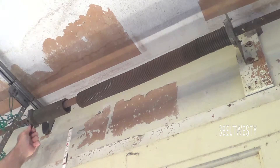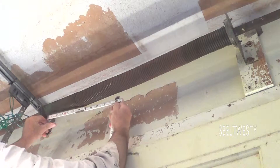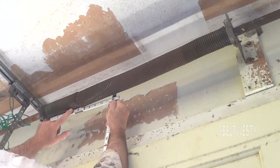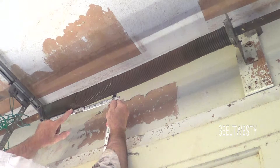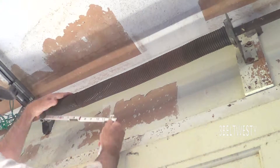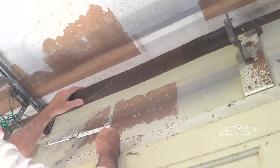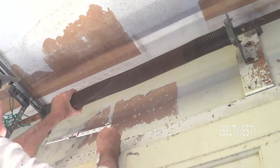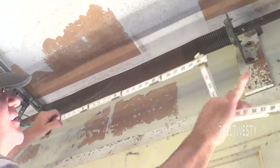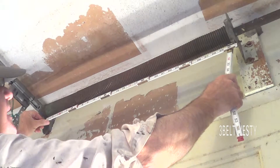I've gone through and undone the two screws on here. If I go over here and count 20 coils, on this particular one that's five inches. What that means is the diameter of the wire is a quarter of an inch. That's actually better to use than a caliper. If I put this together, the overall length is about 30 and a half inches.